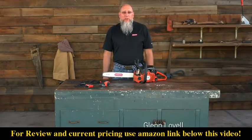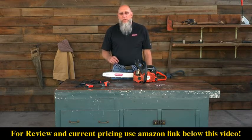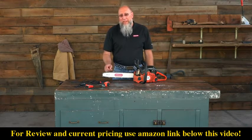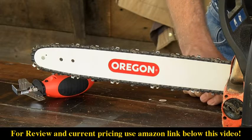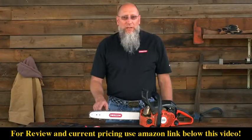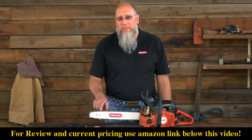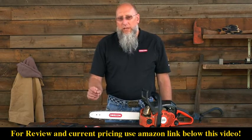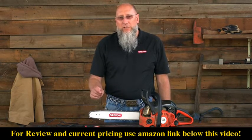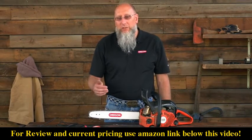Today we're going to talk about the SureSharp mini grinder, but before we get into that, there are a couple things you need to take into consideration when you sharpen your chain. The first thing you need to look at and check is for damage in your loop chain. If it has come in contact with the ground, a fence post, or a rock, you're going to need to identify the particular cutter that has the most damage — this is the cutter you're going to want to start grinding on. When you grind, you want to make sure that you've removed all of the damage in that particular cutter so that the cutter is back into good chrome, it will hold an edge, and the cutting performance will actually be good.